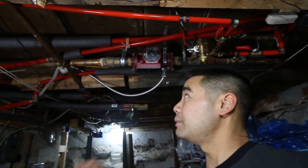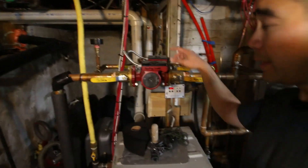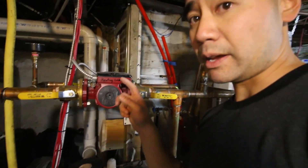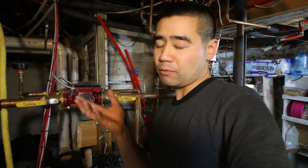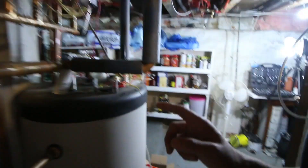Anyways, it's just a bad job — I know it's a bad job. Let's talk about troubleshooting the circulating pump. Over here I have the boiler system itself and here are the circulating pumps. I can hear that this one is working for the heating loop. In my system I have two pumps to circulate water through my heating system into baseboard heating — it could be the same for a radiator. The way I test to see if they work is I listen to them. I'll put the microphone up so you can hear it — this one is actually working.